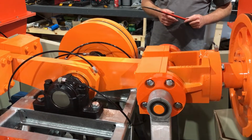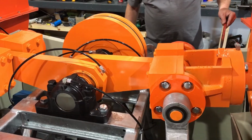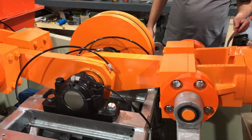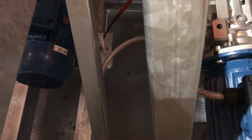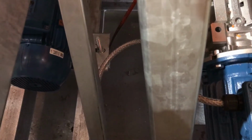The shake drive belt is tensioned in much the same way. It's only a single belt on this because it doesn't have any axial movement, but you can see if we look down in the bottom here, and it's quite dark, the motor mount works the same way. The motor is mounted 90 degrees, so it tensions the other way, and there's again 2 nuts top and bottom on the swing bolt to adjust the tension.